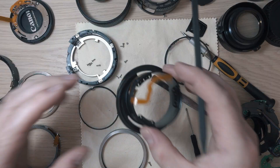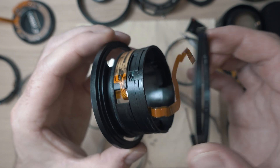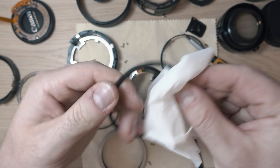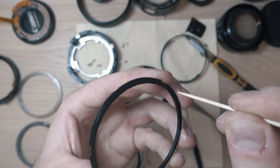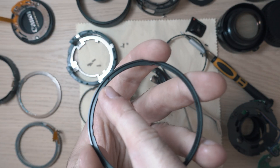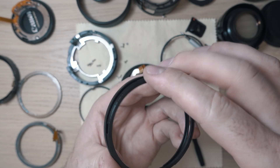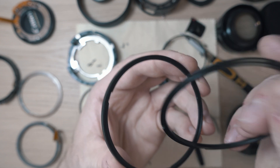The terminals also run here. Remove the plastic ring and separate it into two pieces. Clean all lubricant from all parts as that is the cause of incorrect focusing, so take your time and clean it properly. This ring has a small notch — that's the side facing the ring with a focusing chart. The second ring has only one way to go, so make sure it is on like so.